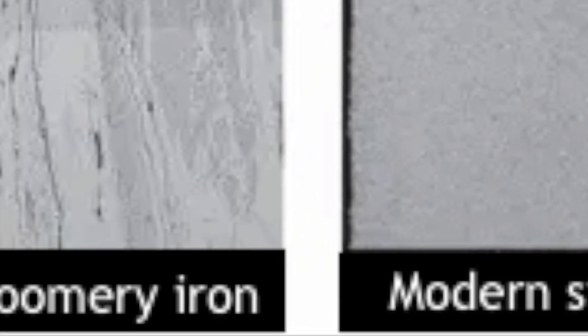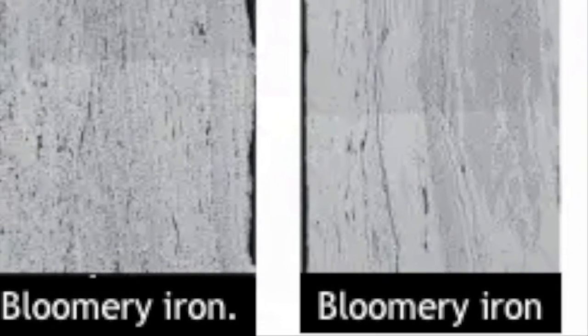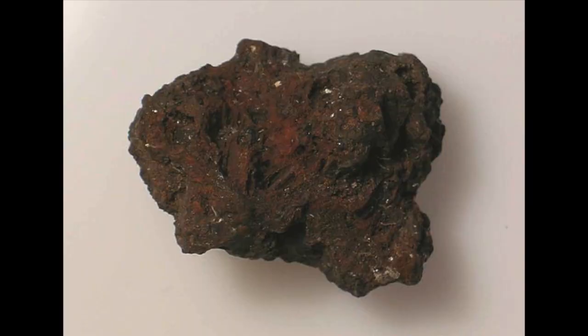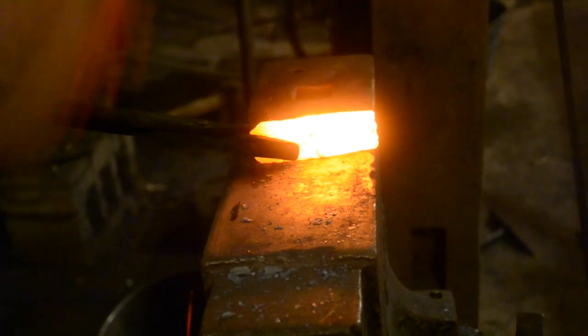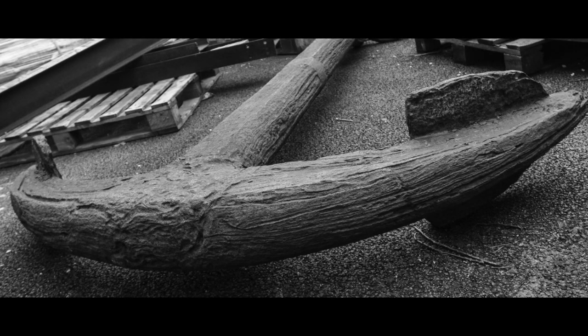In the historical, the grain is coarse and fibrous, like a piece of wood. This is an iron bloom, or a lump of sponge iron. This is what it looks like when it comes out of a bloomery furnace. It's a spongy mass of iron full of voids, and it might contain 15–20% slag by weight. It is unusable in its current form. Before use, it needs to be compressed down and all of those voids filled. Then it needs to be folded and welded again and again. This folding and welding will squeeze out the majority of the slag and close up any voids. The metal fibers and the veins of silica have all been stretched and stretched. Wrought iron from a later period went through a similar process, and the grain in lightly corroded antiques is often visible to the naked eye.